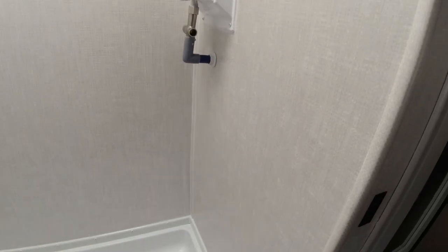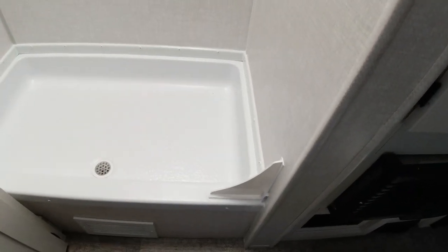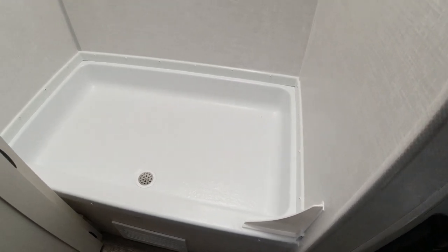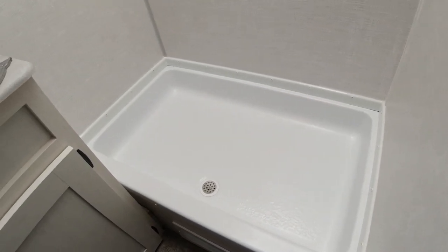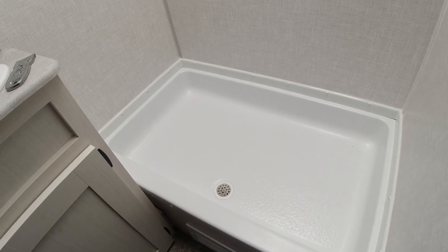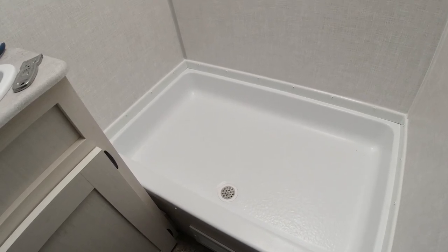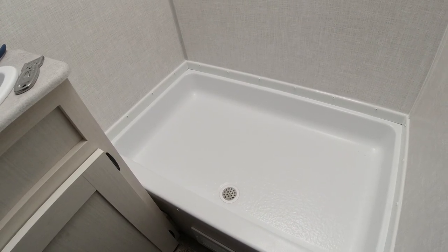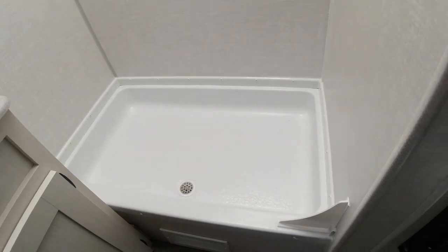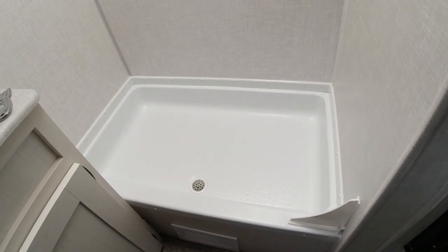I'm going to try to get as much caulk into that seam as possible and then put some caulking in here to basically create a dam, so no water can get back in — because that is where our water is coming from, around the edges. I'm no expert, I just do things as looks best to me. I'd like to know if any other folks out there have been having the same issue. We've done all kinds of work thinking it was other things, and it ends up just being a poorly designed flange on the shower, which is kind of disappointing. I'm not the neatest when it comes to caulk, but it is back together — I think I may have fixed that issue. Let me know in the comments if any of you have had issues with your R-Pod shower leaking and what you've done to fix it. Thanks for watching.